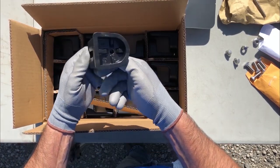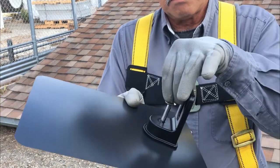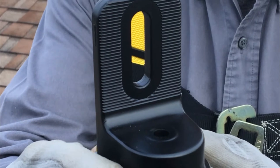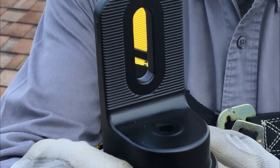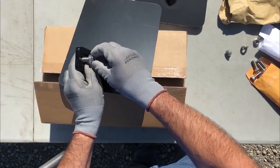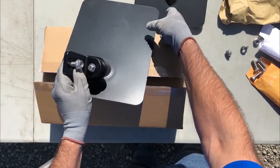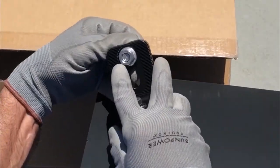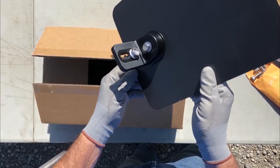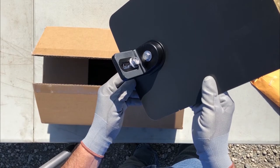To see it assembled, the L-foot easily sits on the flashing with the lag screw inserted into the flashing cone. The T-bolt fits through the L-foot slot, which has 1.5 inch vertical adjustability. The bolt head provides a visible slot to verify the T-bolts are turned correctly. And there you have it, the Pegasus Composition M10 L-foot Install Kit.